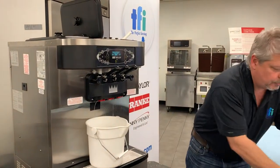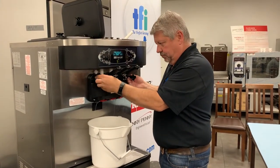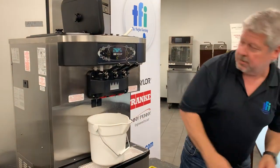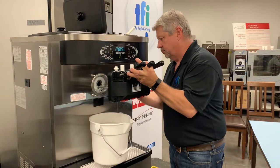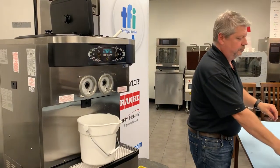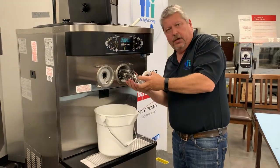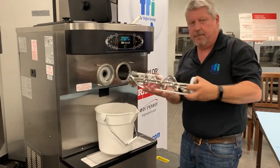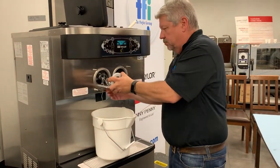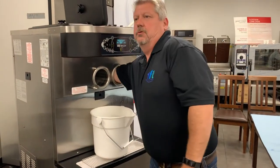The hand studs come off — these two, very simple. This whole freezer door slides out. Next we have the beater assemblies. I have my hands holding on the blades so they don't fall off, and I just lay the beater assembly down. Then the next beater assembly, and finally the drive shafts.